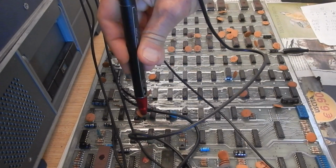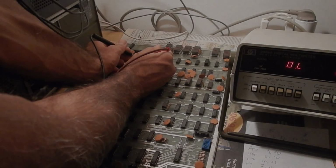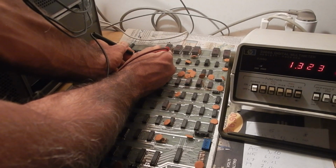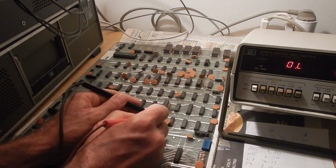But none of the ICs is showing high current on D2 or D3 pins. Since it is not a shorted IC, it must be a physical short somewhere else. So now I'll search for the minimum resistance value on the ICs that are connected to both D2 and D3 to get near the problematic area.